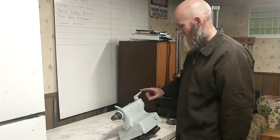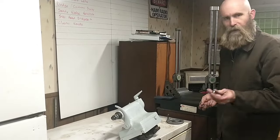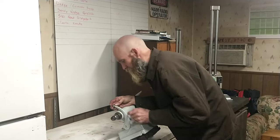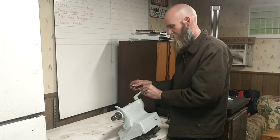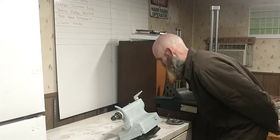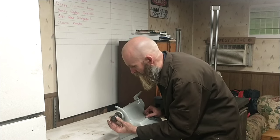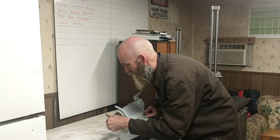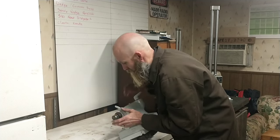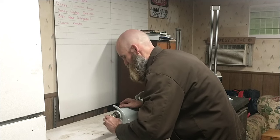I'll show you my solution for this: I got on eBay and got some three-quarter-inch steel bearing balls. I'm going to try cleaning this all up and brazing those onto the tips of these two handles, then buffing it up. I think I can do a nice enough job that it won't look glaringly bad. The big thing I see and I'm not sure about is that bushing at the back end that appears to have just walked out. It's hard for me to believe that Monarch would design it that way, so I'm a little suspicious of that.